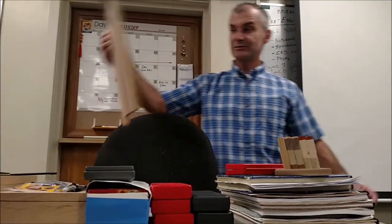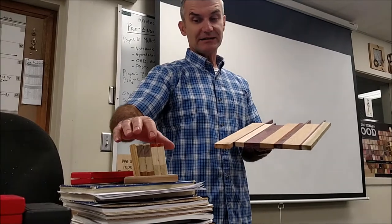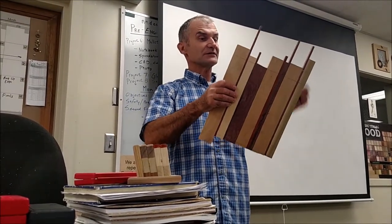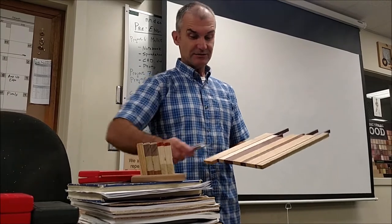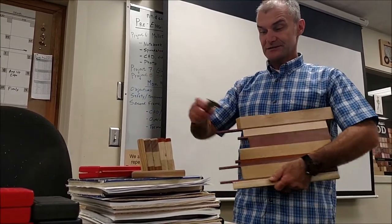You want to make sure you have about 9x12 or 8x12. After clamping overnight, unclamp it and it's going to come out like this. Then use the planer and bring it down to about a half inch — it'll be hard to get it exactly a half inch, so plane it all the way down. Make sure you leave all the tabs on the sides because that's how you'll fixture it down to the CNC. When you're done planing, use the calipers to find the exact thickness.